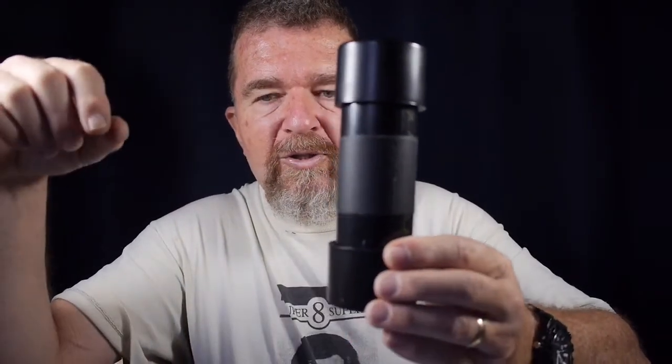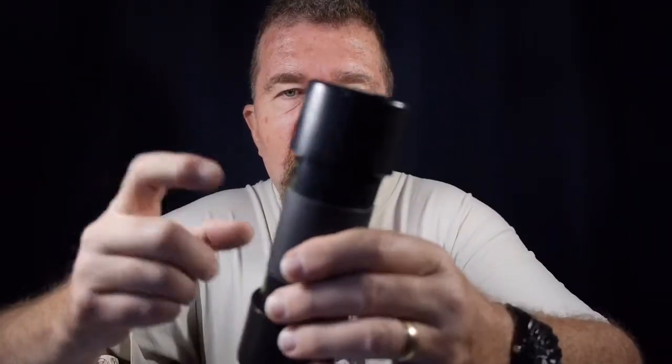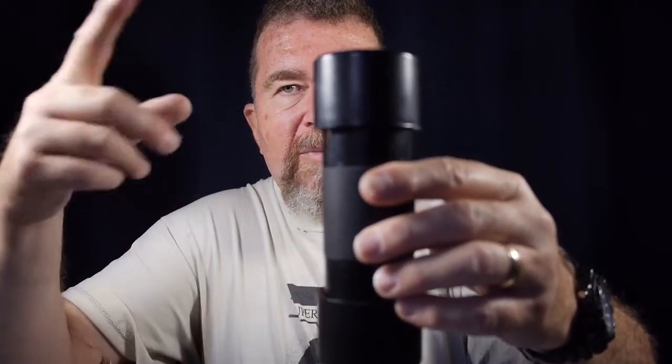For the electrical cord, you could take an old extension cord and cut one end off, but they sell wires where the loose end is already stripped and solder-tinned, so it'll wire right up into one of these sockets just fine. We're going to make one of these pre-flash light sources. The open end of the cap — the end that comes off — I'm going to drill a hole in it, put a paper disc in it, and that'll be the aperture hole. This tube will end up hanging down off the enlarger instead of the metal can type light source — a plastic body, a lot safer than using a metal can.